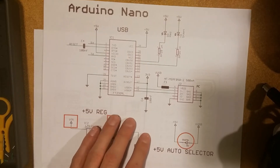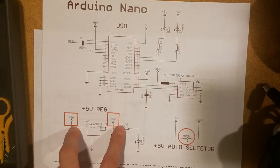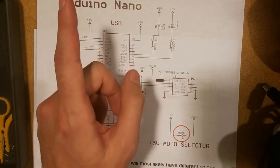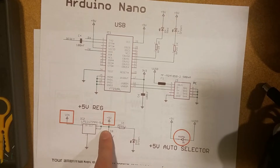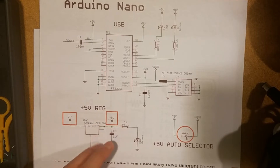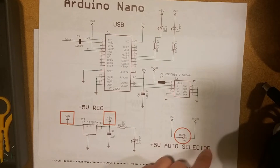I've never used a Nano, but in theory it would work. We still have V-in and 5-volt pins to choose from, and we also have a protective diode on the USB. So in theory, if we were to connect the 5-volt wire on the controller to the 5-volt pin through a Schottky diode, then we would have 4.8 volts for the Arduino, which is enough. And that would protect voltage from traveling back to your computer or from your computer to your Wii.